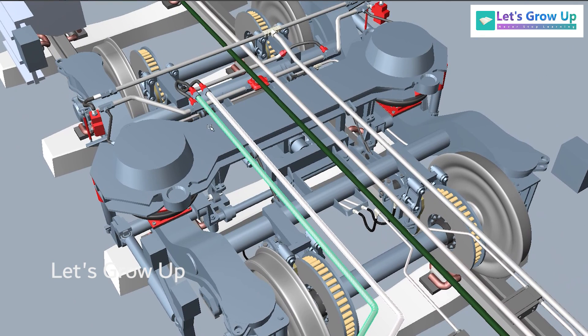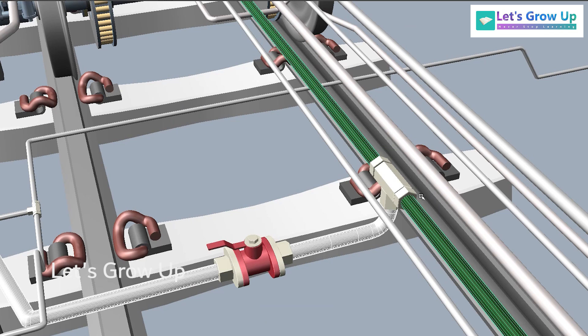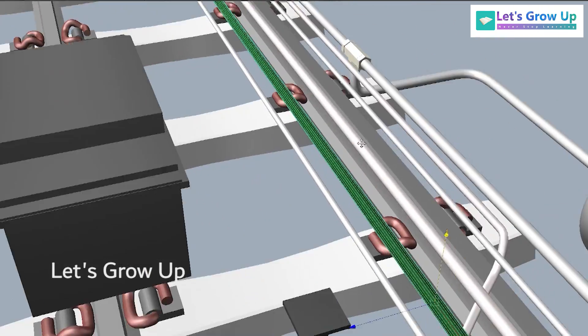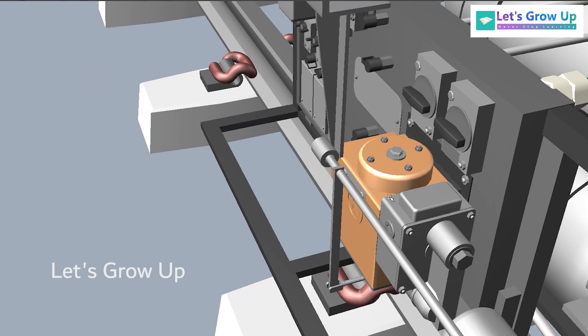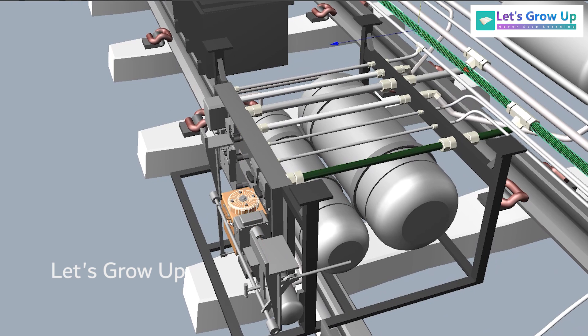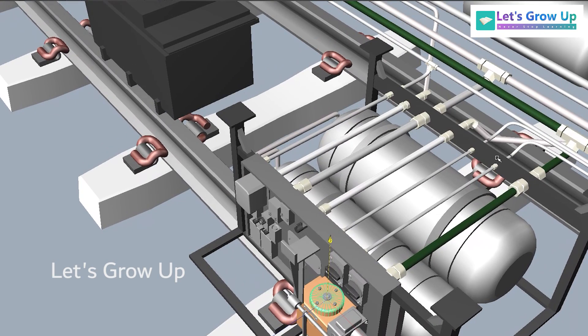When these two pipes sense any leakage inside the air bellow — via the duplex check valve and the leveling valve — FIBA drops the air pressure inside the BP. Inside this pipe there is 5 kg per square centimeter. This pipe is connected through the branch pipe with the DV (distributor valve). The BP is connected with the DV through this branch pipe, and the DV is the main part of the brake application system in the coach.